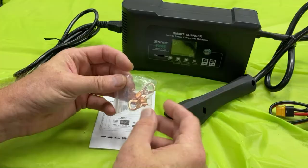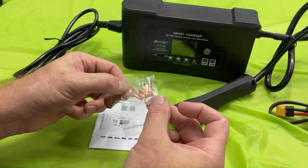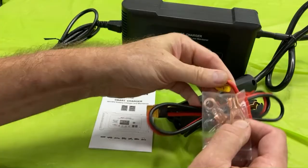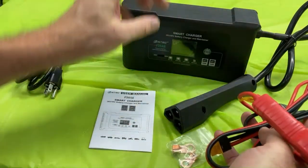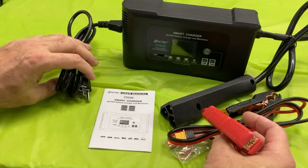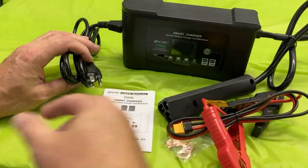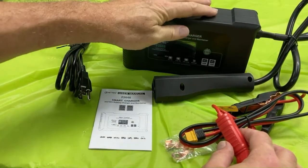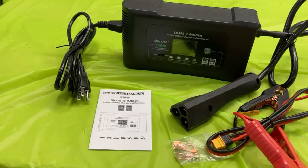This also fell out of the box — a couple of terminals with markings for up to 60 amps. You could cut off the clamps, attach these terminals, and connect directly to your battery with plus and minus, which would allow you to mount the charger box directly onto your mower. You'd then just need to find a place to store the cable or build a wall-mounted connector on the mower. There's not a lot of room inside, so I think I'll stick with trying to get the existing plug to work in the back of the Ryobi after rewiring.